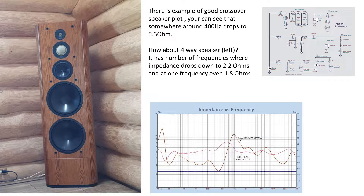The previously used Cambridge premium lineup amplifier burned completely, with no way to repair it — and Cambridge is a good manufacturer. The amplifier provides good short circuit protection but is not protected against reduced speaker impedance. One component overheated, creating a chain reaction and burning the power stage to the ground. Our product worked fine for a long time, but when outside temperature hit the limit, overtemperature protection was activated.